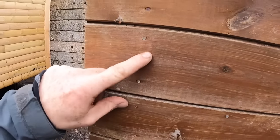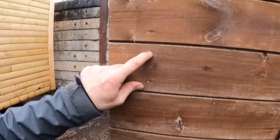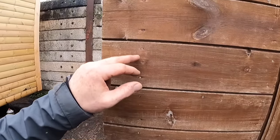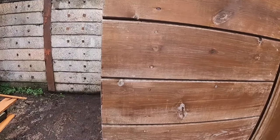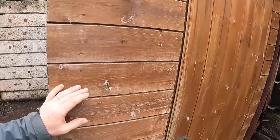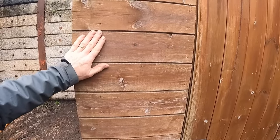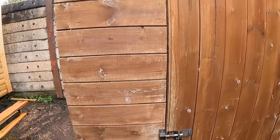For hardware feedback — these boards are fixed with hand-nailed galvanised ring-shank nails and they've held up really well. I'd suggest that if I'd used screws it probably would have been less tidy and might not have held up as well. Don't be afraid to just get a hammer out — it's the most inexpensive way to build something. Hammer and nails is how buildings have been held together for centuries, and there's nothing wrong with it. In fact, I use nails more now than I did five years ago.